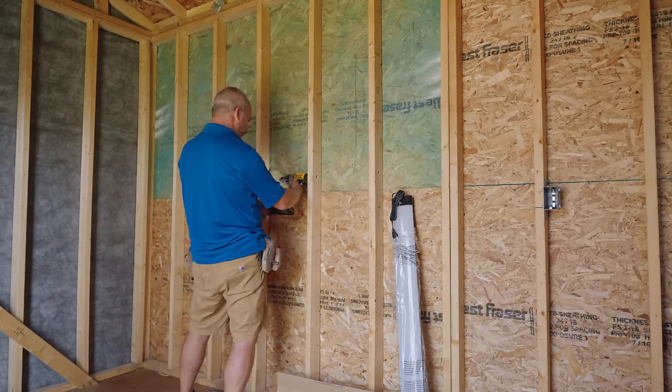but it is a great way of mitigating or reducing the risk of a fire in your box when you're putting in and taking out your plugs. Sometimes over time, you'll get the wire in the wrong spot. These screws will get a little bit loose. You put a plug in and you have to yank it to get it out. It's a little tight. Things start to wiggle and shift and undo and move around, and bam, then you get that contact. So if you're not confident, tape your box while the power's off.